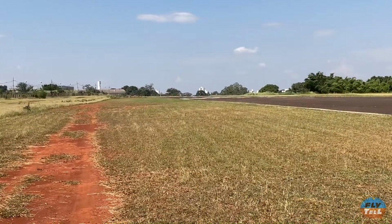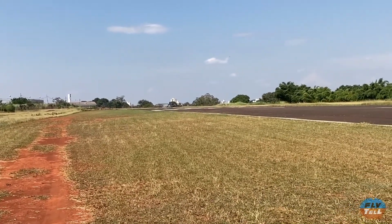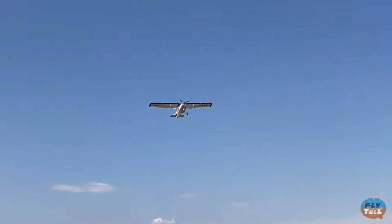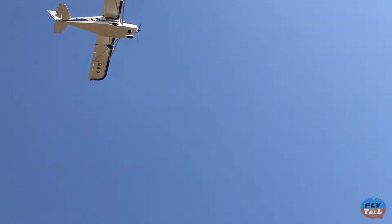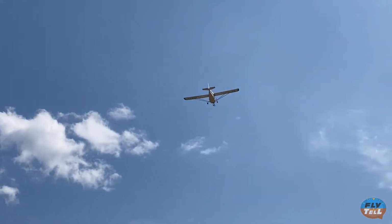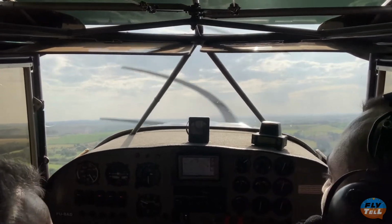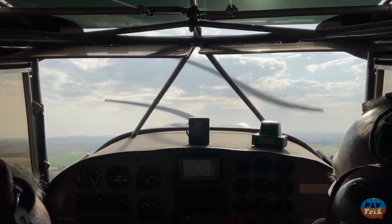This was a fairly warm day, but the Coyote didn't seem to care. We calculated around 600 feet, 180 meters for takeoff. And that with a pair of 200 pounders and 3 hours of fuel on board. Climb was done at full throttle, maintaining between 60 and 70 miles per hour, keeping an eye on the oil temperature, which never got too hot for comfort.